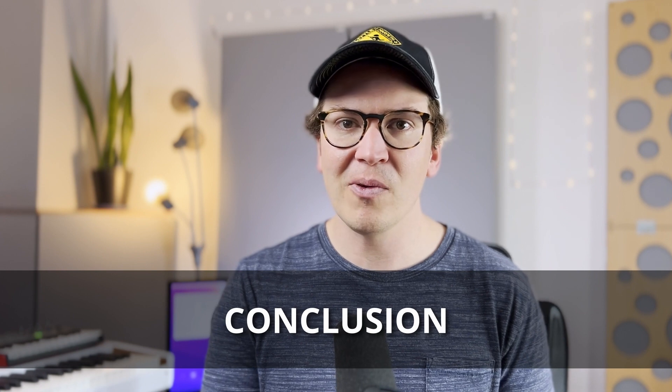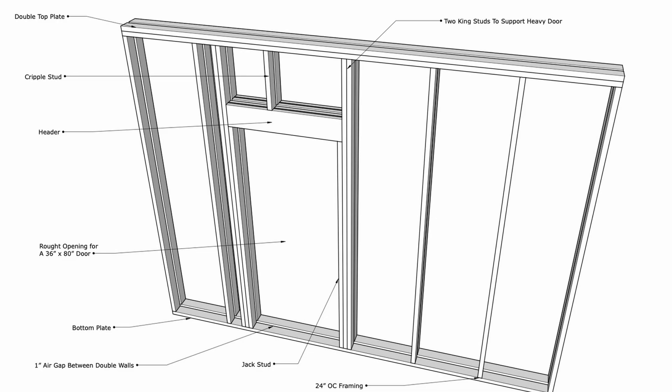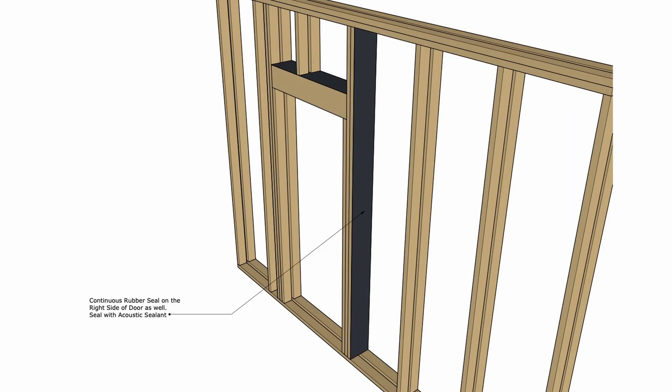That concludes part one of this video. I hope it was helpful in giving you a lot of my secrets and what I've learned — this is what I would tell my clients when I'm trying to get them to build really high-quality solid soundproof doors in their studio. To review: remember to do two king studs, not just one, on each side of the wall. Remember to use sway bracing on the inside wall and put rubber along the outside of your king studs and also on top of your header. Make sure to use the materials I recommended — or something very similar — and if you have a tight budget, you can knock it down a couple notches. Stay tuned for part two, coming out next week. I look forward to teaching you all more about soundproofing and home recording acoustics.